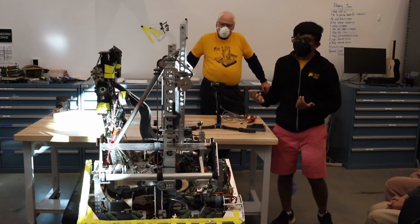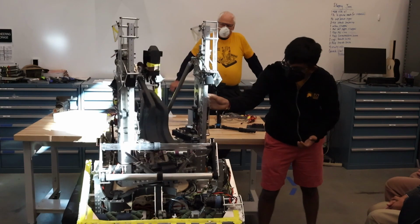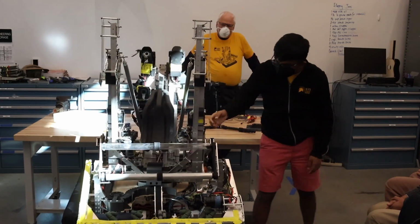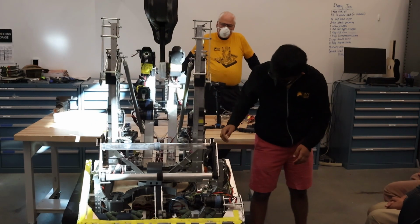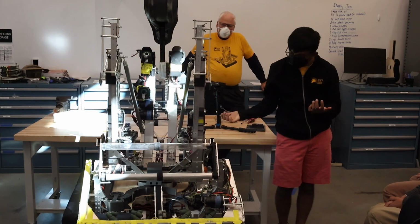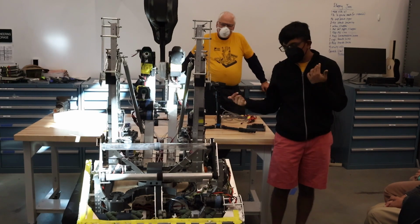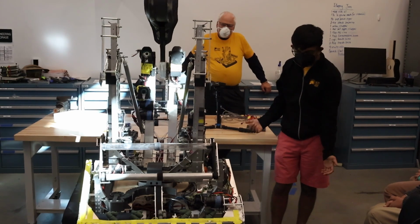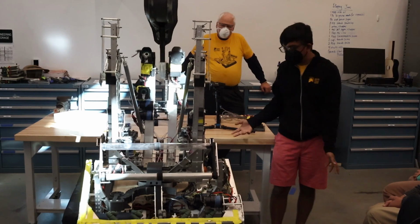It's really helpful. And another thing, we used servos on the robot this year. To power the servos, we used the Rev power module for servos. It's not very visible, but it's right here. We just used 18 gauge wire coming off of the PD board for the 30 amp slot. It didn't take up much power. It was pretty easy to put in. We didn't put in any hot glue to hold it in, because we didn't see any issues with that. We also really like our zip ties, so wires probably wouldn't have come out.